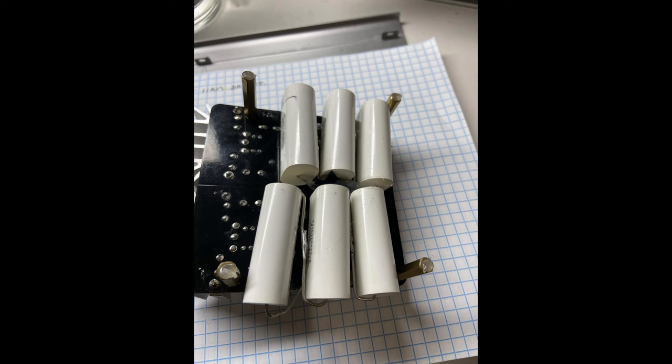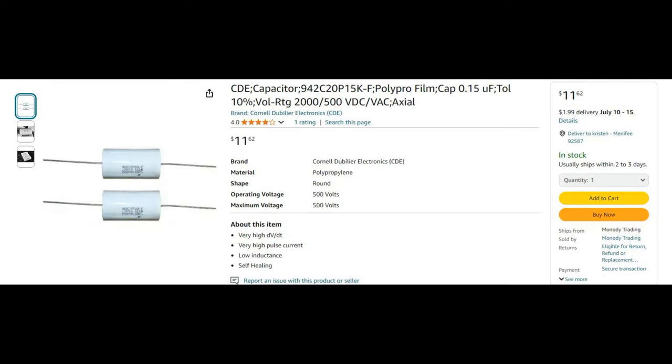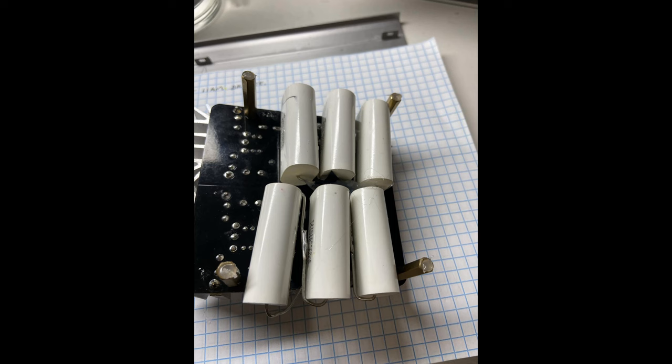I currently do not have the link for these capacitors, so I do have capacitors that'll also work. This is the one that I use in my ZVS Tesla coil. They do work, however, changing the capacitance anytime you do it, it's going to change how you resonate on your number two coil. I will leave a link for the ones that I buy in the description, and if Shawn gets back to me and tells me which ones he buys, I'll put it down there and I'll specifically say they're from Shawn, and you'll be able to link to those and buy those as well. Once we have the capacitors all soldered in, our ZVS driver is ready to go. There's nothing more you need to do to it. It's ready to go.